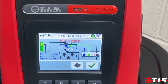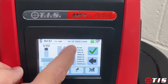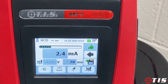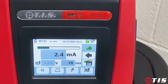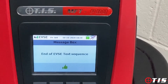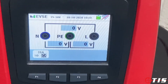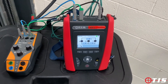My dials don't need to be moved. We tick the box and it performs the 6 milliamp DC RCD test. The RCD test is done — 2.4 milliamps at 78 milliseconds — so the RCD test is all good. We save it and that's the end of the test sequence, all now saved to my MFT Pro. And that is our MFT Pro EV working in conjunction with our EVTest 100.